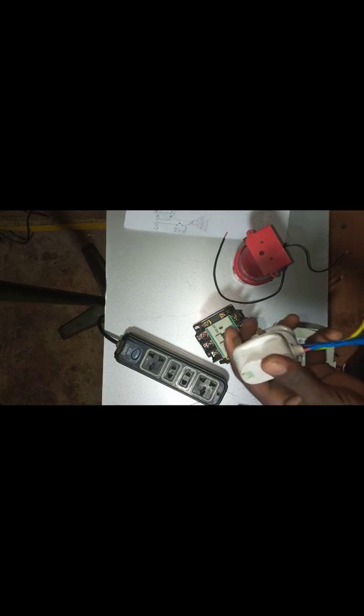The load to my house — to supply my house. So I will be making use of this one. The automatic changeover I'm building uses one contactor and two different supplies. I call this one supply one and this one supply two.